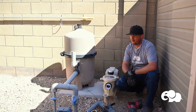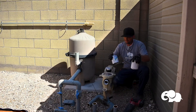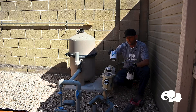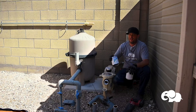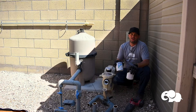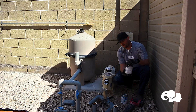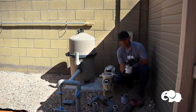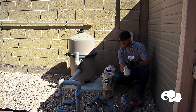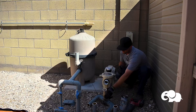I'm going to grab my glue and primer. I've got pool primer and pool heavy 746 weld glue — that's the glue I really like to plumb with, it's a tight, really high-strength glue. For primer, I use all-clear primer — the Weld-On pool primer is clear, looks like water, and smells like acetone. Pretty strong stuff.